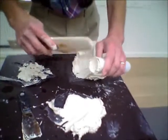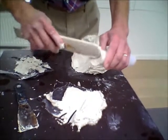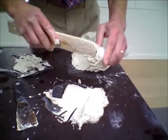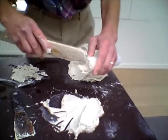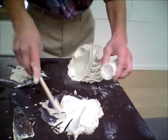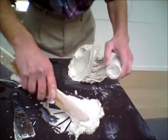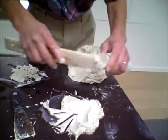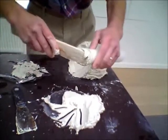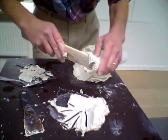You see I've been very careful not to get any air bubbles into it as it fills. If there are some air bubbles it's not the end of the world, but you'll hear them popping through as it prints. You'll get a little scar on the surface of your print, but then being clay you can always just sort that out later. I just actually have a handheld syringe with clay in it, and that can extrude as required when you're doing repair jobs.